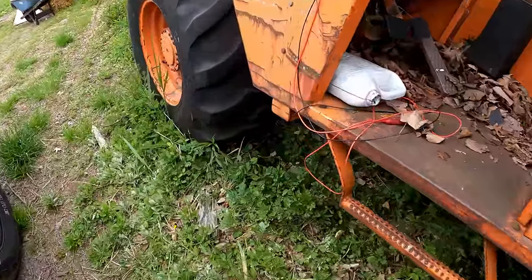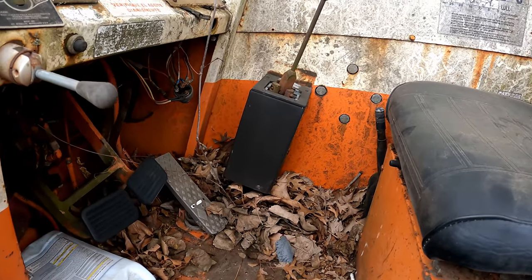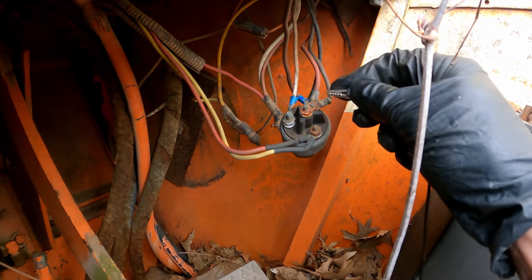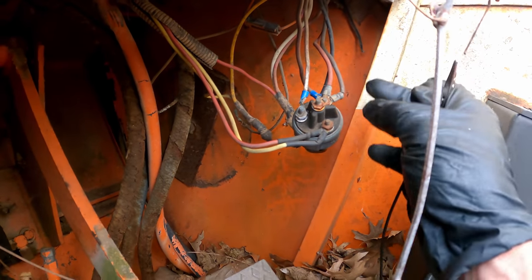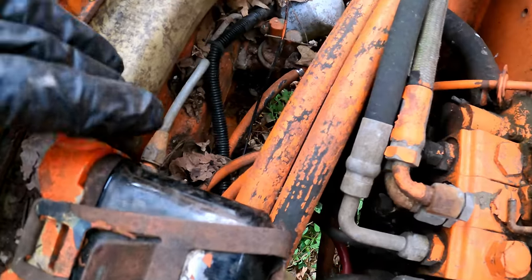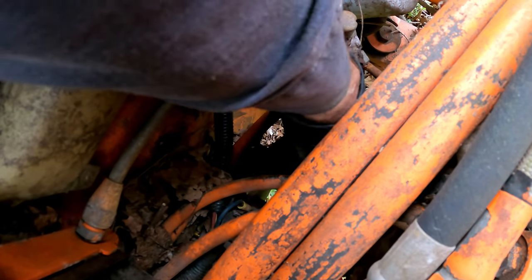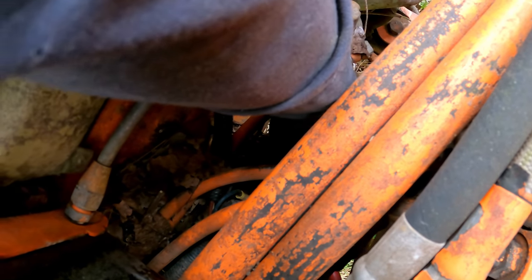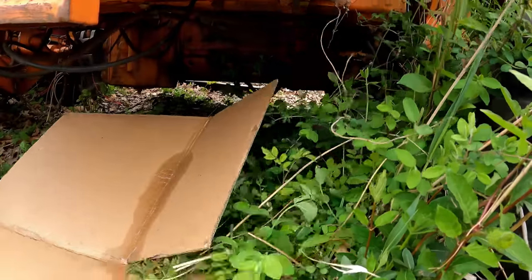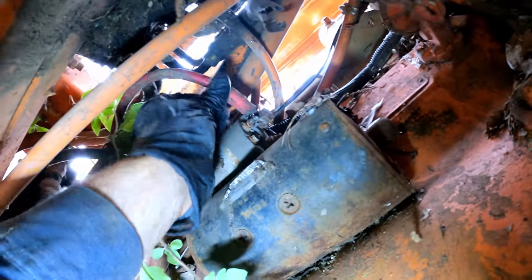I got power sent to this and of course we'll check the oil level if we could see it — to see if the motor even moves. I'm just kind of tapping around, got nothing. The starter's right down beneath the fuel filter and actually that's where the smoke smell's coming from — oh, the solenoid is on fire! That thing's scorching, almost like power was just being sent to it the whole time.